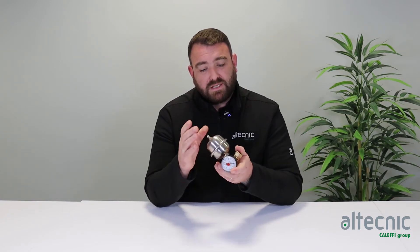So we've put the two together, so when you've turned the water on you can see what your system pressure is, and then you can set this shock arrester to suit the system requirements and make sure we get a carefree life with the product itself to remove that water hammer noise. It comes in 15mm compression.